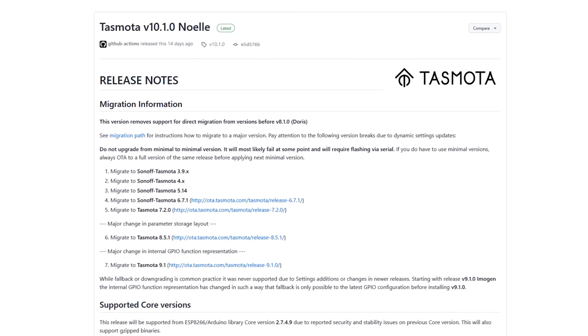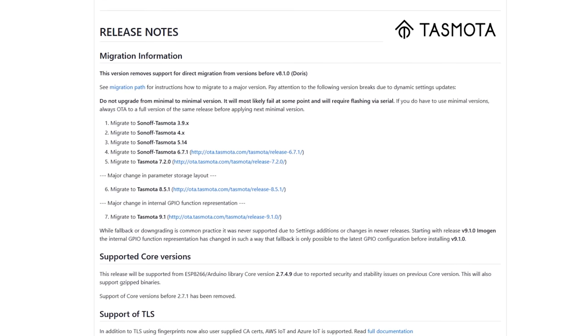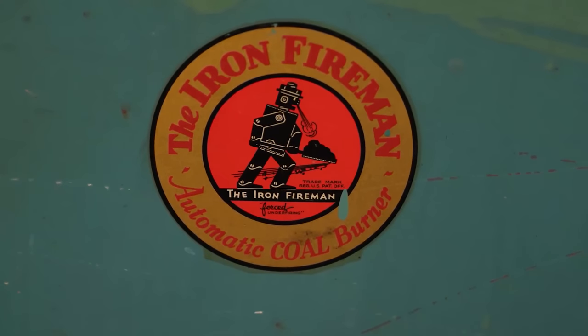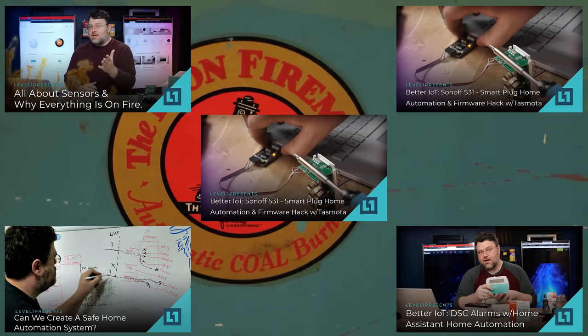Enter Tasmota. Just like their wireless control system switches, where we modified switches to turn them into our own Internet of Things devices and set them up to subscribe their events to the Mosquitto broker running on Home Assistant — yeah, you can do that here too. If I just started speaking some crazy foreign moon language, we've actually done five or six videos on the Internet of Things, starting with repurposing the Iron Fireman thermostat for a modern home control system. I'm assuming you're at a point where you have Home Assistant ready to receive events from IoT devices, and you may even have a separate IoT network. All of that's covered in past videos, so if you're interested, watch those and they'll get you up to speed.